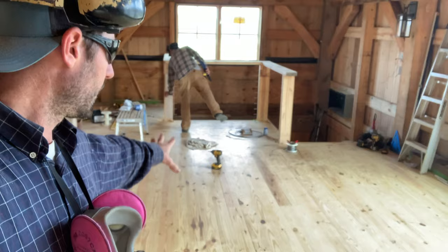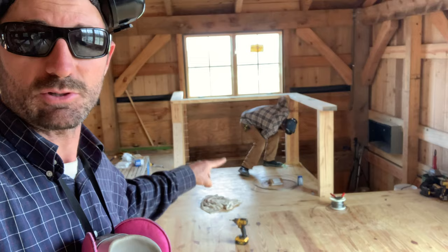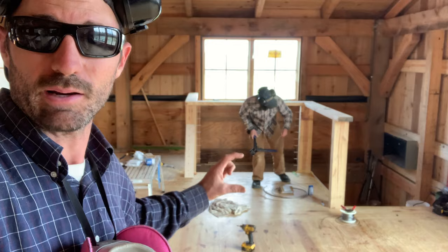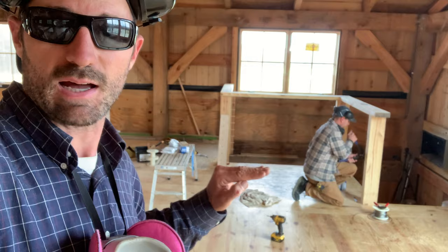And so what we've done is we make a 4-inch on center mark on the template that Mike just showed us, and we center that in the space between the top cap and the finished floor. We might have 3.5 on the bottom and 3.5 on the top, but 4 inches everywhere in between. We want a nice even symmetrical spread. So once we figure that out, we cut our template down to whatever it needs to be so that we have centered top and bottom.